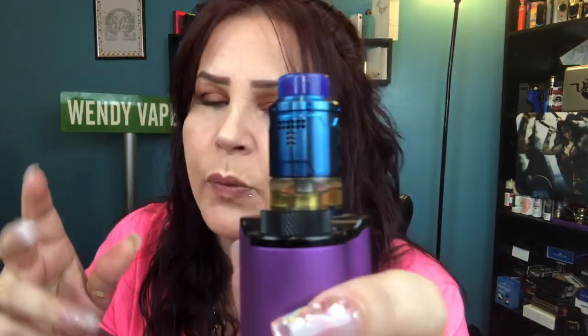If you close it off, which you can, and you decide that you want to close off, let's say, the bottom and half of the top, this has now moved the airflow kind of sideways to your coils, so it's not directly going to hit your coils as it would if you had it shut down maybe by 2 rows or not at all. So either that way or just by the 2 rows like this, then it'll still be hitting your coils right on. Other than that, it's actually veering off your coils.